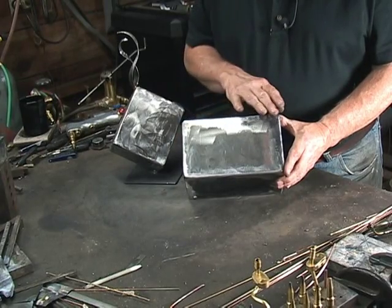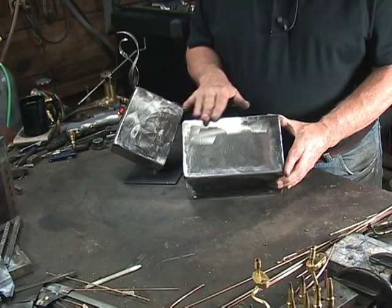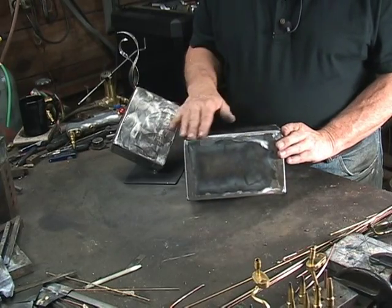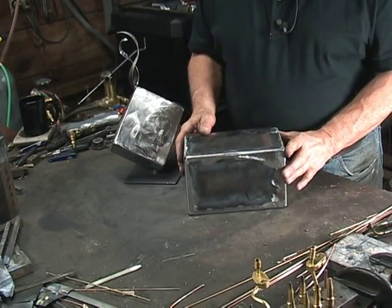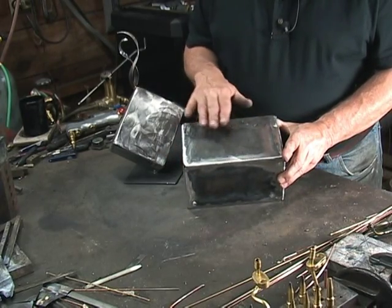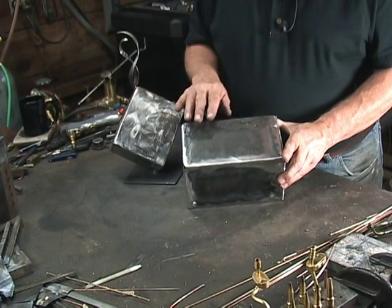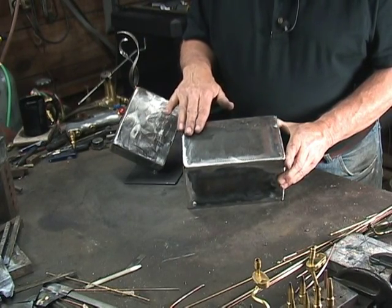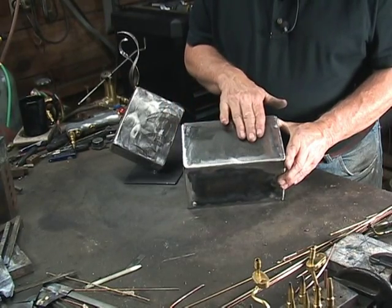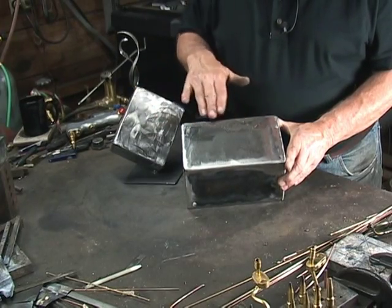As you can see here, I've finished this box. I've got some very nice seams here, which I've sanded very smooth. Got all the corners done. Now I could finish this box somewhat like I've done this one — that would mean taking a four-inch grinder and grinding this kind of gray surface down, then a sanding disc and getting these swirls, smoothing everything out.